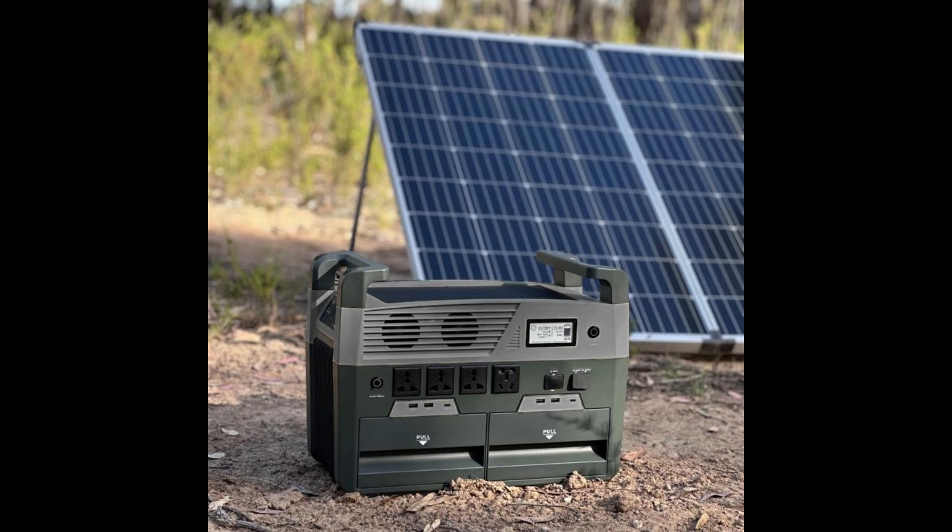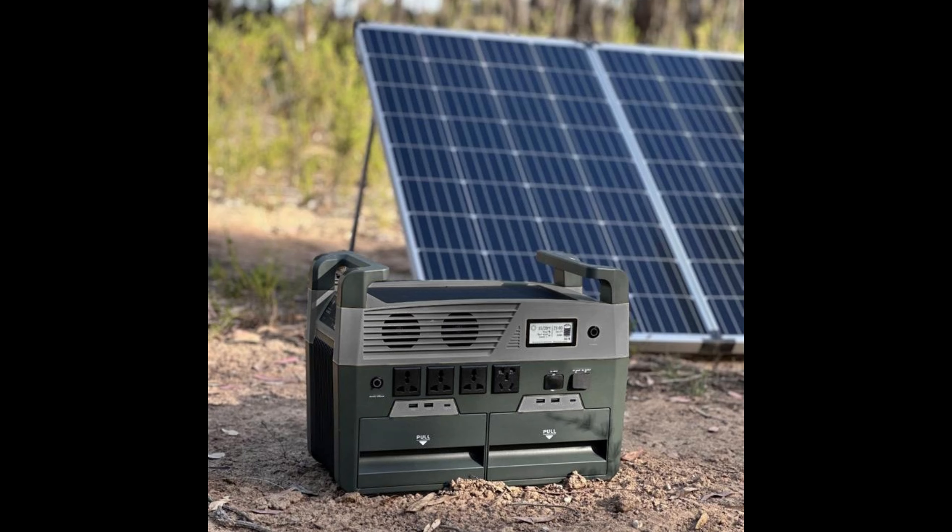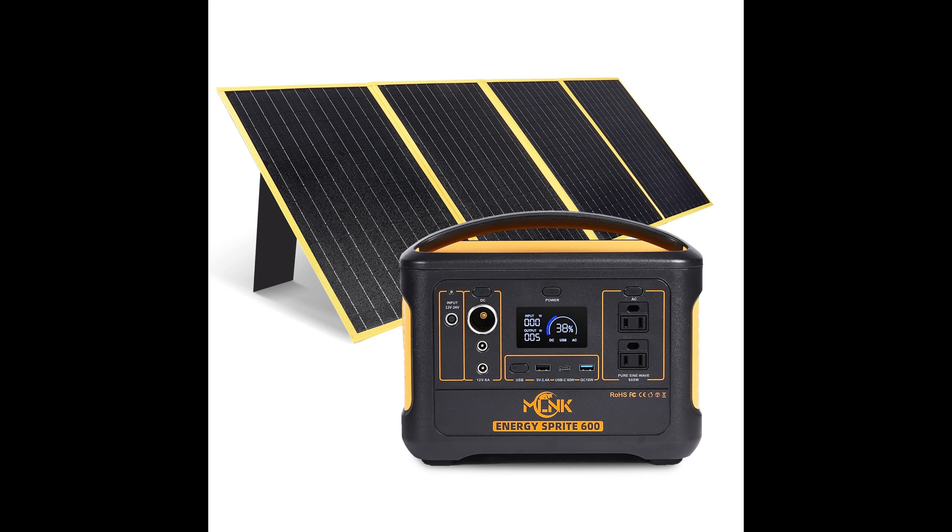When it comes to RV, yes, you can buy larger ones — 1500 watt, 2000 watt units. But there you want to look for something a little different because you are kind of limited to what's in them. If it has a certain amount of battery capacity, you're stuck with that. What you want to look for if you're getting one for an RV is something that can handle more solar inputs, because some of them are limited to 200 watts. If I was going to run an RV, I'd want at least 400 watts of solar power coming in, so I would look for one that can handle 400 or even 600 watts coming in.